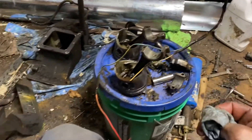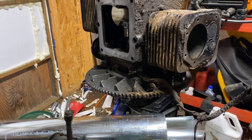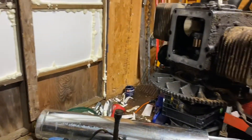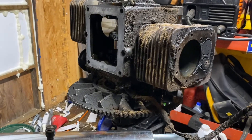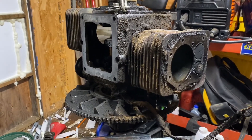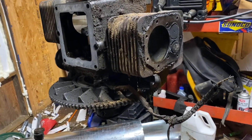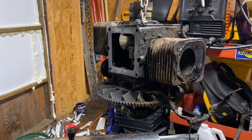That should conclude this video — thanks for watching, please like and subscribe, and stay tuned for more as I get this K646 back together. Once parts arrive it should take probably two or three weeks — sourcing parts for the K646 are kind of difficult, so I'll have to wait for payday. I might do two parts on putting it back together — probably do the pistons and rings first, then the valves after. Actually, I've got the valve lapping compound and the valve lapping tool, so I'll probably lap the valves and clean up the heads while I wait for parts. There's a lot more to come.